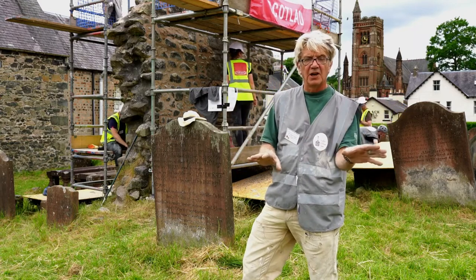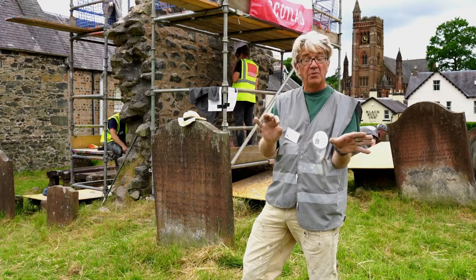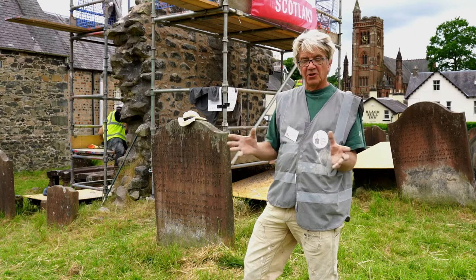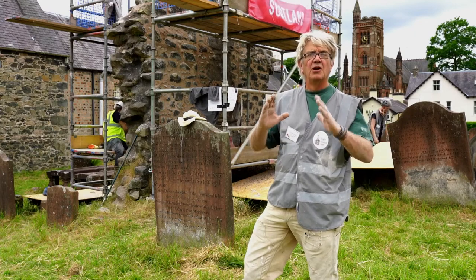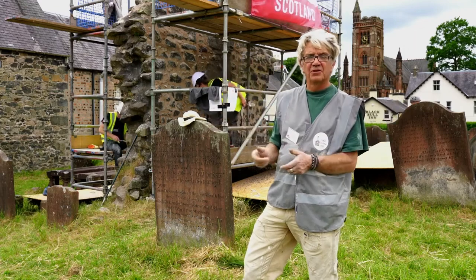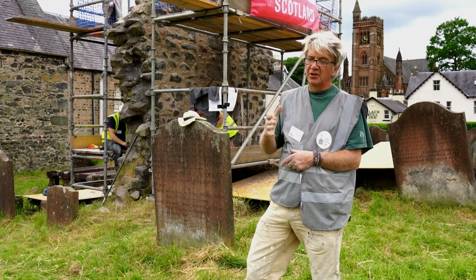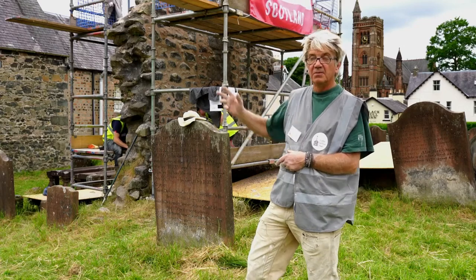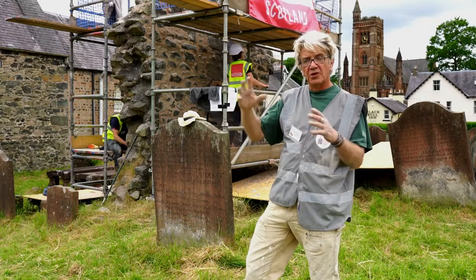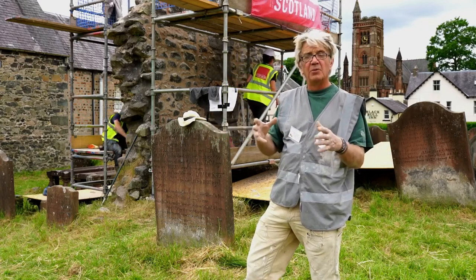There's a benefit to the craftsmanship and the quality of the work and the durability of the bond that you make, because you make a good one, and the key common denominator in both of those is lots of pure lime in the mix, as much as possible according to the purpose. And so you see here we've got not quite a pure lime, but nor a very hydraulic lime that we're using for the general face work. That's the most breathable.